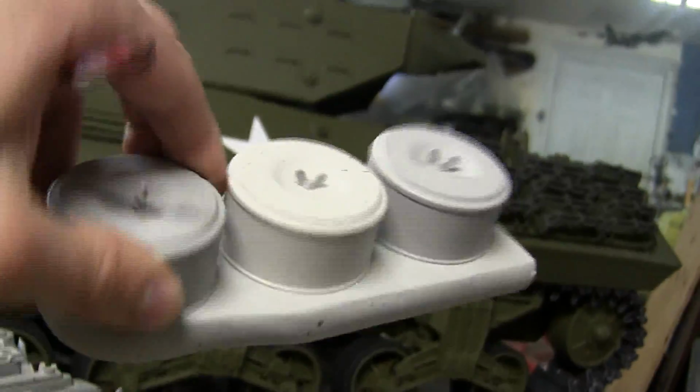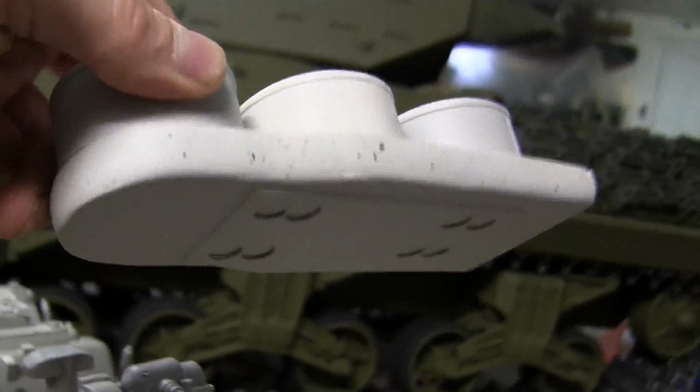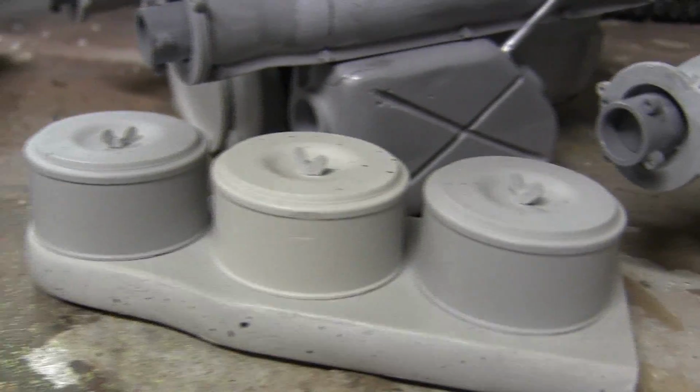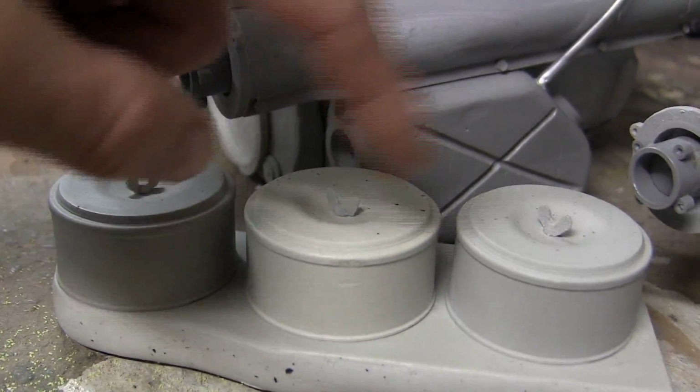When the location of the magnetos changed, so had to change the design of the air filter. On the 210, the air intake manifold used a single duct with three small air filters that were held together, which covers were held together via wing nuts.